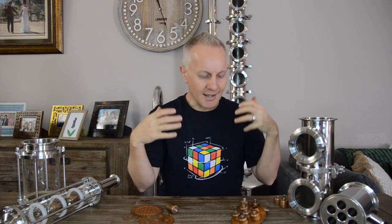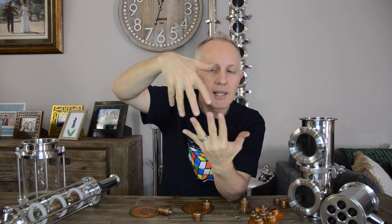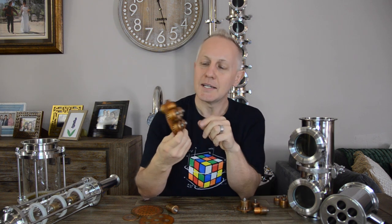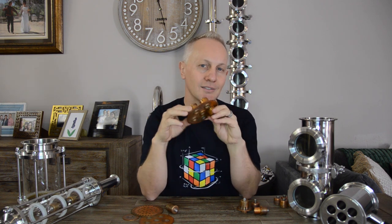I know there have been a few bubble plate videos out there, but I want to show you my take — especially the perforated plate. In a sense, bubble plates work with the cross flow of vapor and liquid that forces the vapor-liquid interaction. Take this bubble cap tray for instance — it's got five bubble caps and one downcomer. Now how does that liquid interaction work?